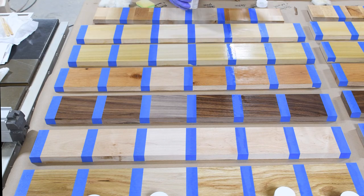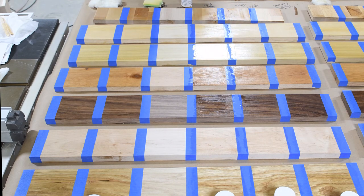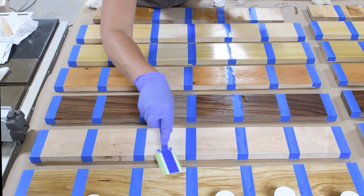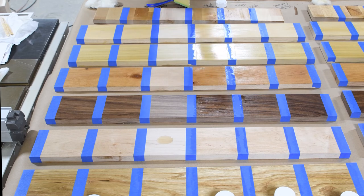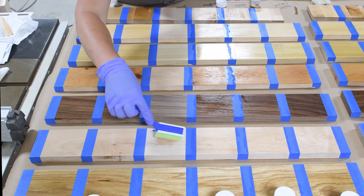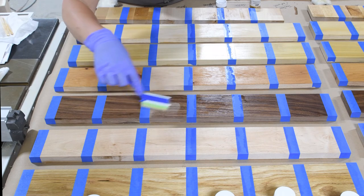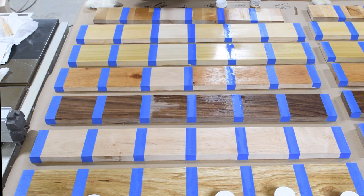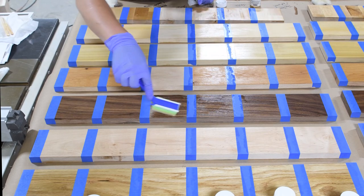I'm already seeing this satin losing a lot of sheen after only a couple minutes. Then we've got our high gloss urethane, which does not need any stirring. With the urethane finishes, you don't need the full 24-hour dry time between them — you need to wait at least six hours between coats. If you're over 10 hours, you might want to do a very light sanding to make sure you have proper adhesion on the second coat. It's also recommended to do three coats of the urethanes.